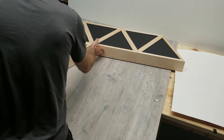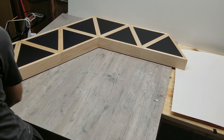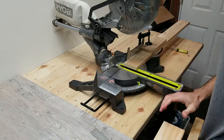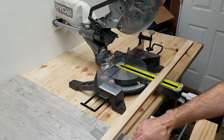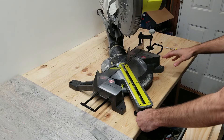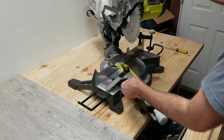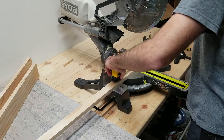We are about halfway done, and this is kind of how I envisioned it hanging on the wall. I also want to build some LED floating shelves to go under it to really complete the look. For the first floating shelf, I need two pieces of wood that are 36 inches long — the same 1-inch by 4-inch wood used for the triangles. I'll also need a 1-inch by 2-inch piece of wood cut to 36 inches. I'll be cutting one side of the floating shelves at an angle to match the triangles — the angle on the digital finder from the fence to the saw will be 60 degrees. For the second floating shelf, the same pieces but only 30 inches long.